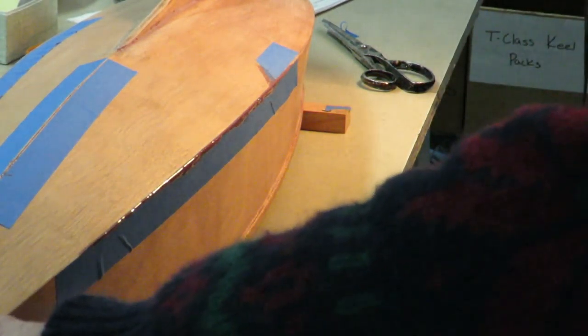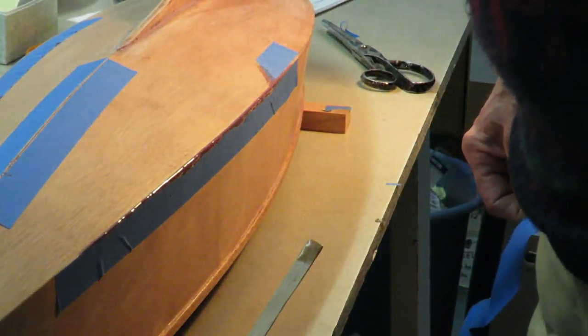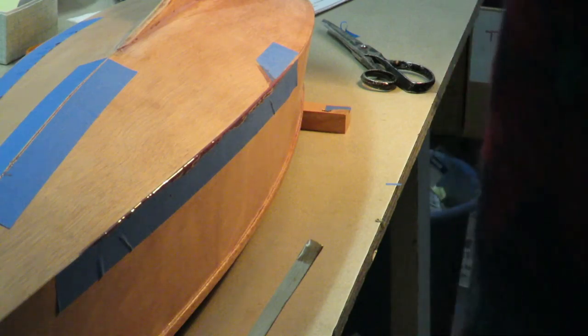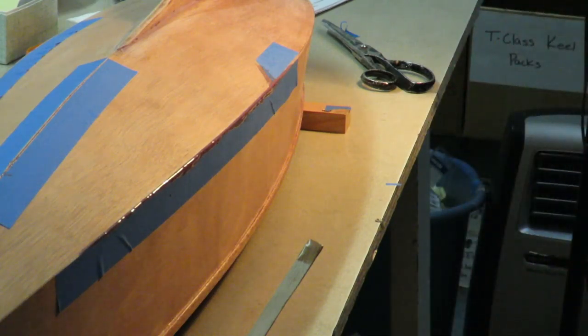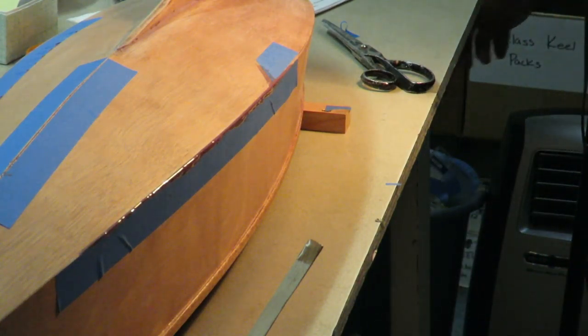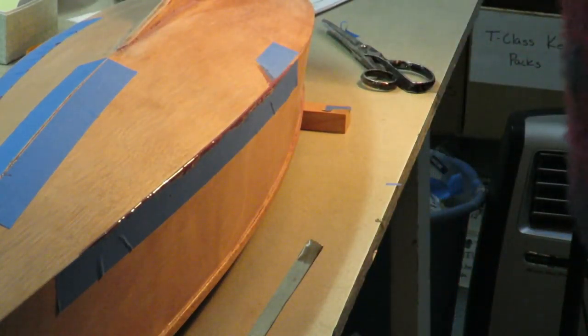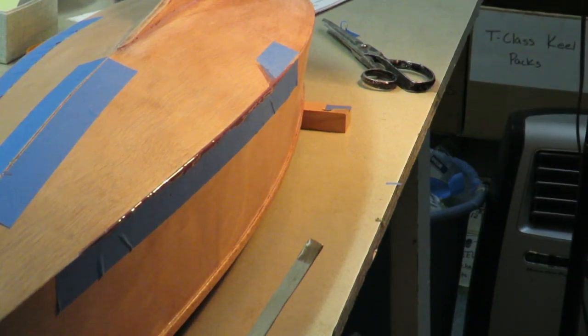Okay, remember your wire tie holes, if you have any that aren't totally filled. Let's hit those, and I'll finish this up and get the center line on the other side, and we'll have a perfect seam along here when this sets up and sands.